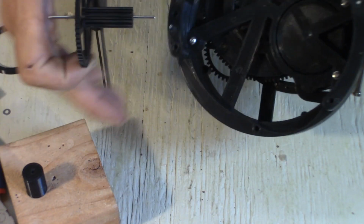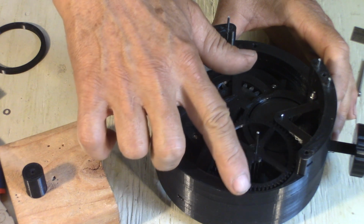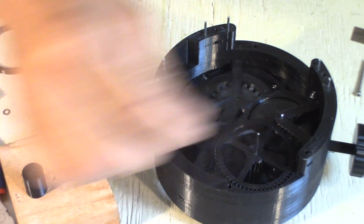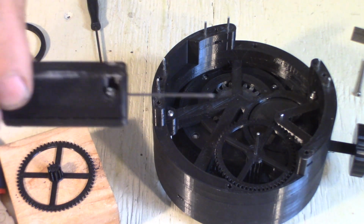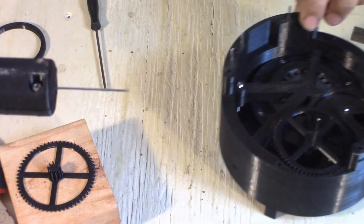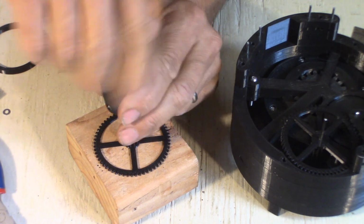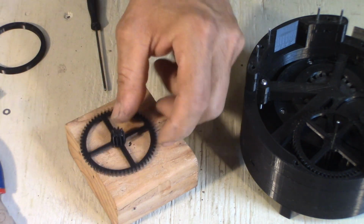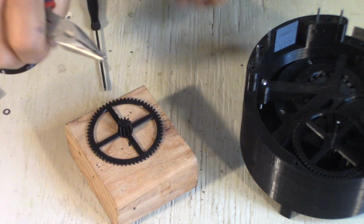This will come in that hole down here, and the gear is going to be at the level of the frame here. Then I have this gear. It's the same principle. Start with the gear like this. I use the 1mm tool and work the hole. Okay, I don't want to do too much, I want it to still be tight. And then the same, take my arbor and pliers.